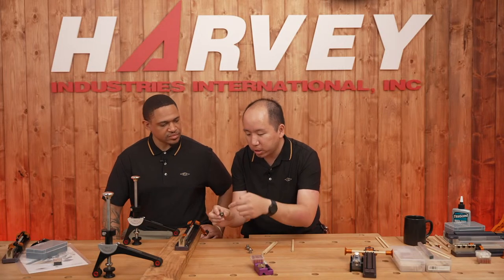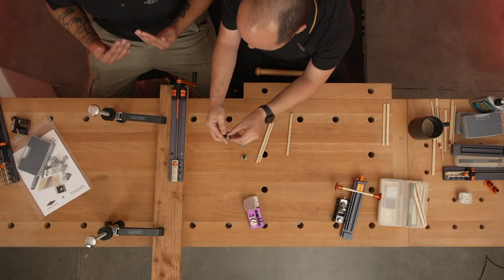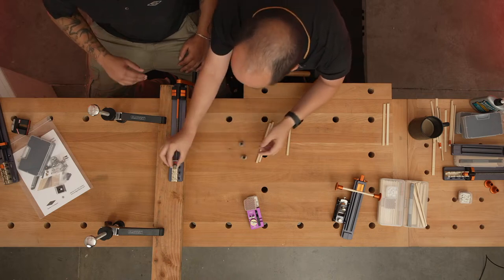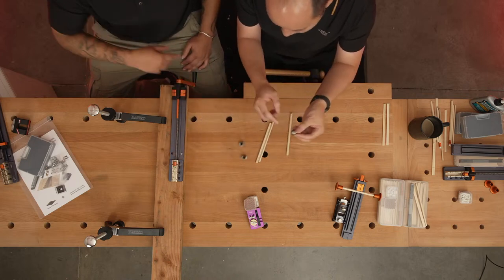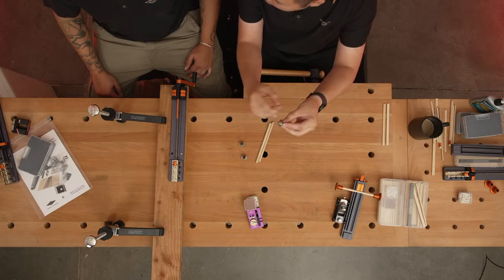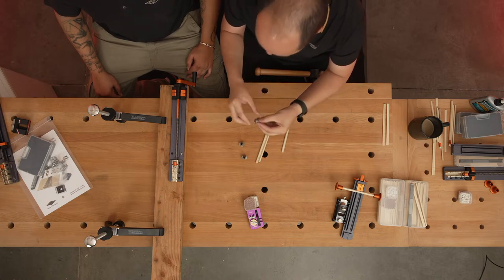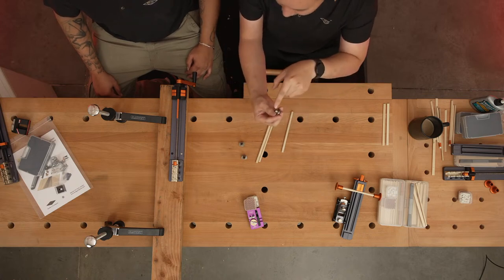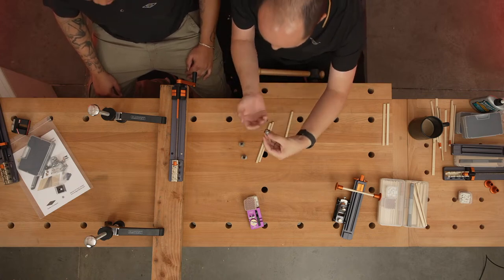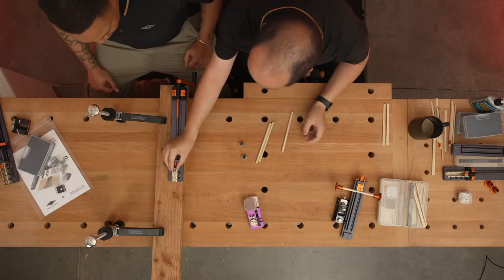When you install these, you want the cone side, or the handle side, facing towards you. Looking at me, not the other way around. Don't face it away. So my pencil will go through the front. Correct. The pencil will come in and hit the cone part, and that's what splits the wood to cut that shape. You don't want it the other way because this is not the cutter side. This is the cutter side. Got you. Always that cone or bevel side facing you.